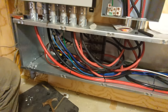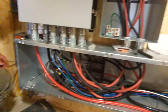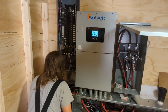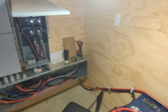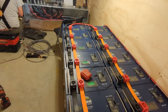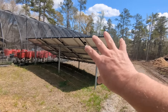We're protecting anyone from getting lit up on the PDBs — they have their inspection port so you can still check voltage. We're going to button this up, put some labels on it, and we have an inspection called in for tomorrow. After we commission this we've got to check on a couple other jobs. Generator issues are probably the biggest problem we run into — Generac generators, generator controls, all that. We also have to go look at another system. I'll show you the solar that we repurposed for this job.